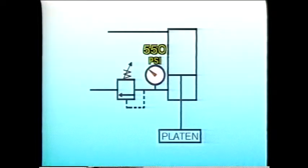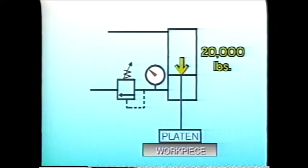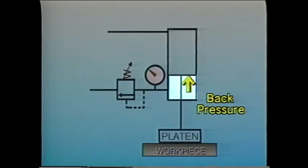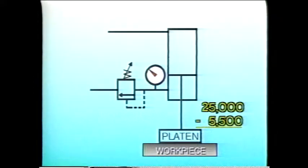However, as soon as the system generates an additional 50 psi in the rod end of the cylinder, the valve opens and the platen goes down. Now, suppose the system's relief valve is set for 1,000 psi. As the platen presses into the work, the downward force is 1,000 psi times 20 square inches, or 20,000 pounds. When we add the weight of the platen, we have a total of 25,000 pounds of downward force. However, with the counterbalance valve set at 550 psi, fluid in the rod end of the cylinder exerts a pressure of 550 psi on the 10 square inch area of the rod side of the piston. This pressure is commonly called back pressure. In this case, it means we are losing 5,500 pounds of force. So, instead of having 25,000 pounds pressing on the work, we only have 19,500.